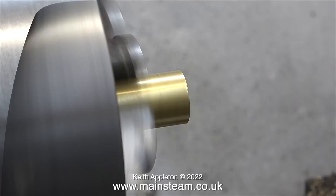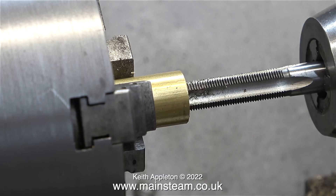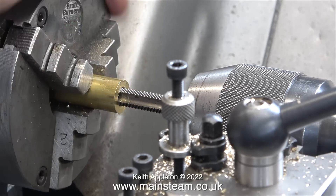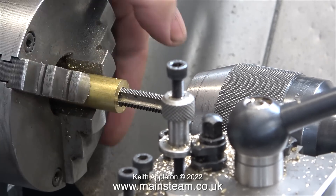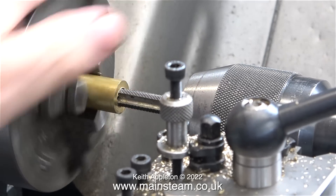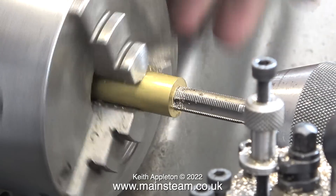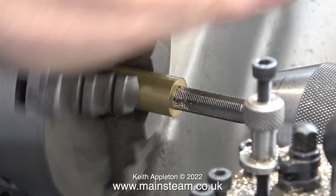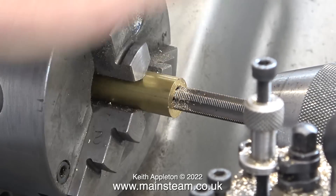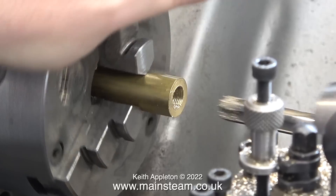After drilling the tapping-size hole I simply used a 3/8x32 threads-per-inch tap and threaded the hole. Here's a different camera angle — as you can see I'm doing this by hand. The lathe is appearing to move, which it does because it's sat on foam pads. I do have neighbours and this lathe sits on a bench; it's not on its own stand and it was making quite a lot of noise when it was contacting the wood of the worktop.